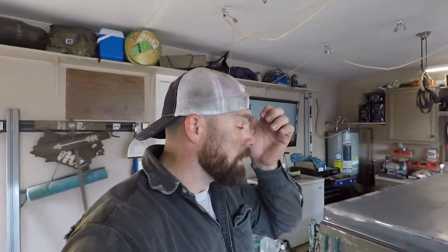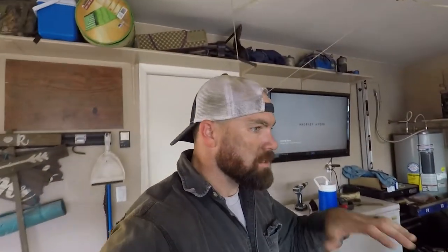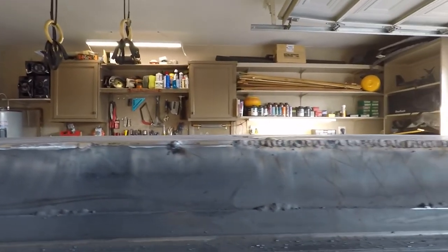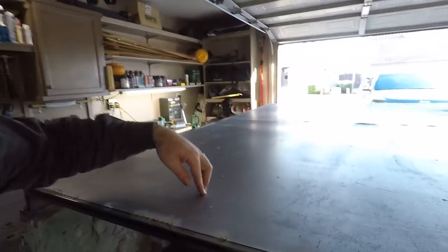That'll do it. It's just slow going, trying to get this thing all stitched together completely, because the heat starts warping the sheet metal. It's only 18 gauge, like I said before, so I got a little overzealous at the onset here, and it's pretty warped. It's not too bad, I guess. There's a slight bubble that you can see right here, but it's just how it's gonna be. Everything is spot welded underneath to tack it in place, so it won't bounce and make a bunch of noise.